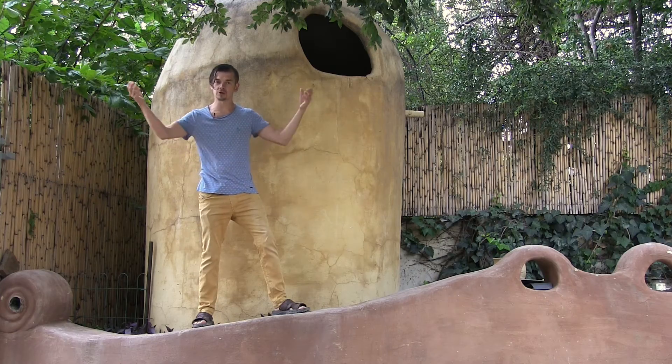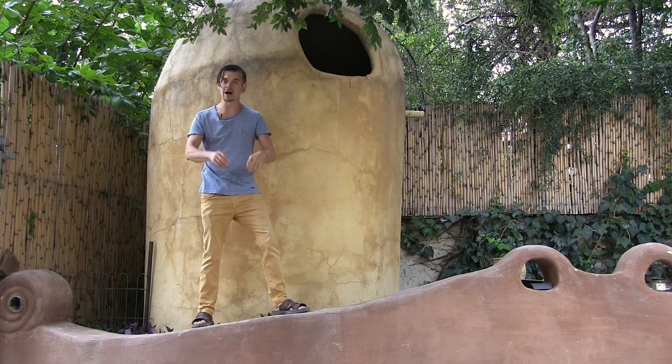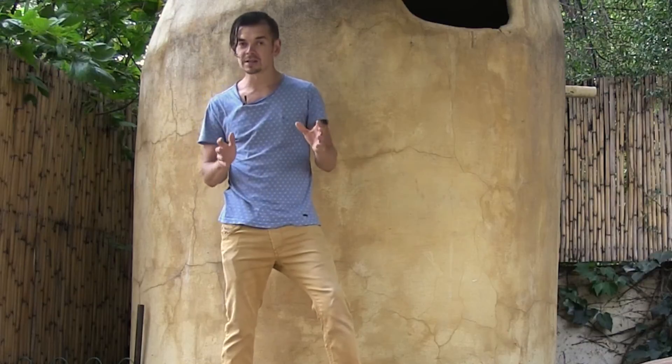The most crucial first step is to make sure that your floor is slanted with a sump — the lowest point of your water tank — having a blast-out valve allowing you to blast out all the settled muck right out without climbing into the tank on your knees with sponges and buckets.